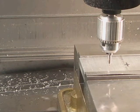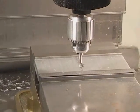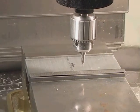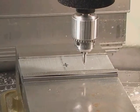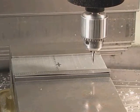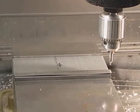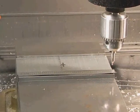This is now a line move from X equals 0 to X equals 6 — the spindle is moving to the right, positive 6. You have to enter a feed rate; here it is 20 inches per minute. Rapid moves are used to rapidly position a tool to start cutting, and then you switch to line moves to actually make a milling cut.